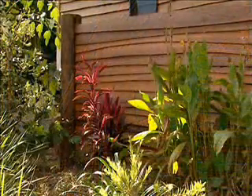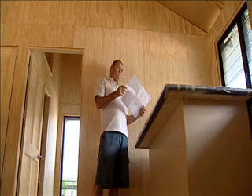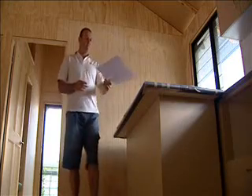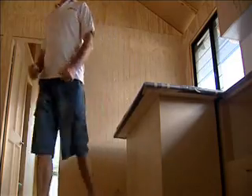We don't use plasterboard in the houses — there's a huge amount of energy and environmental destruction associated with plasterboard. Instead, we've come up with a ply product that looks like the old VJ walls you find in old Queenslanders. The beauty of it is that it's very tough — you can hang your pictures anywhere without having to look for studs, and grab rails can be installed anywhere in the house. It's a really good, long-lasting product.